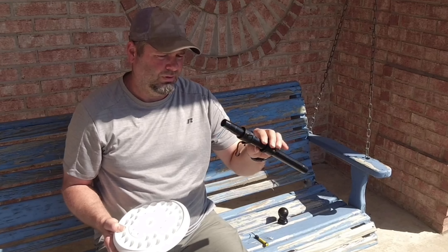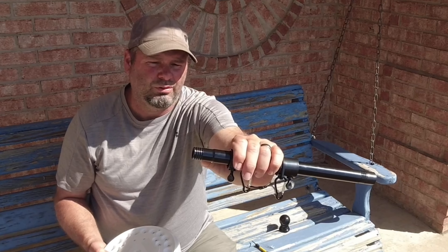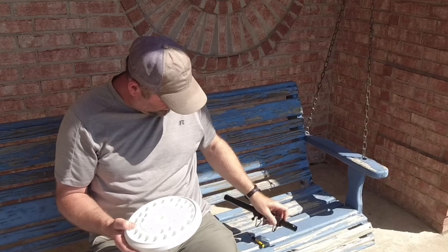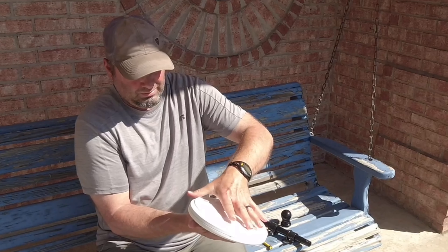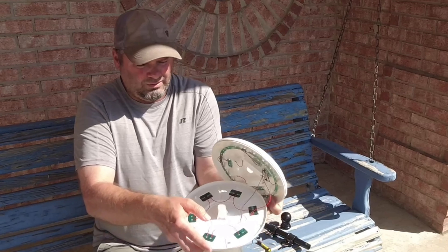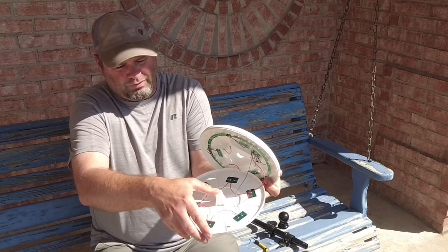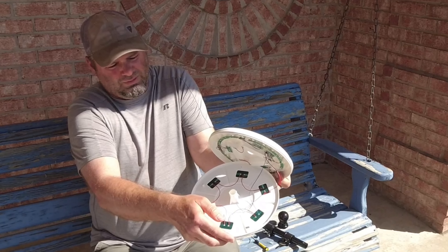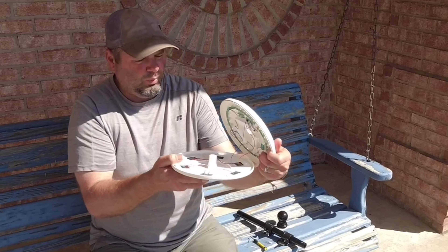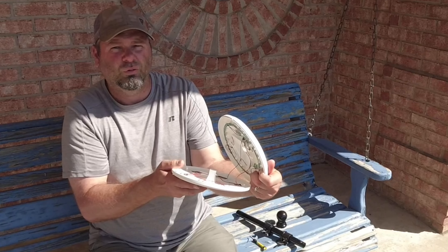I got this pole here — I'll leave a link in the description box below. This is roughly an inch and an eighth diameter here, so you want to go past the screw-on decorative column part. I took this apart just to make sure there was nothing in the area before I start drilling. I want to drill out a one and an eighth inch hole. These wires wire up to the switch — we need to take those out of the way so they're not in the path when we go to drill our new hole.